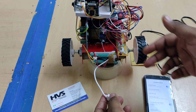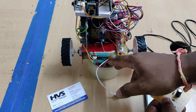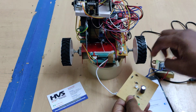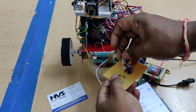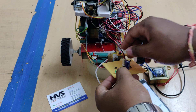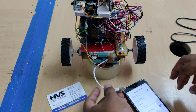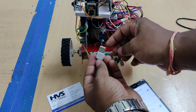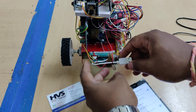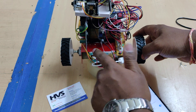This connector is for charging the battery, which also powers the ESP32 cameras. To charge the battery, connect it here and switch on the power supply to the transformer — it will be fully charged in up to 12 hours maximum. After charging is complete, you can disconnect the power supply. This connector can also be connected directly to the USB slot of your laptop or a charger. This is the on/off switch for the ESP32 cameras.